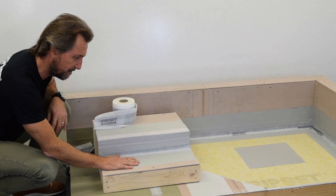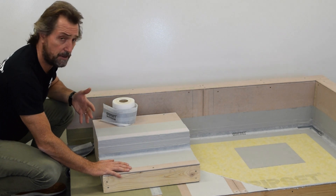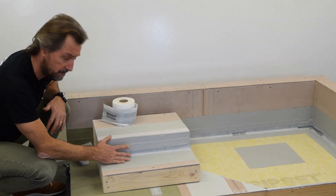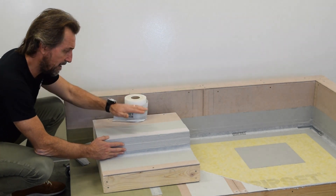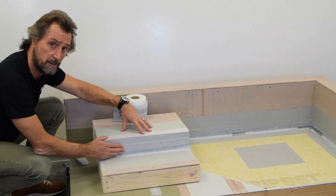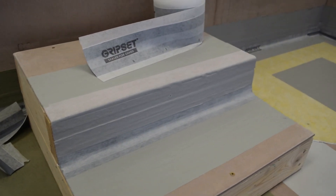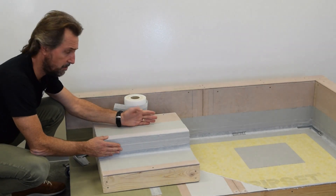In this example we've installed our P39, given the fact that it could be exposed to UV light for a while. The P39 would actually cover the whole section, but I've left it exposed just to demonstrate how the Elastoproof sits at this junction. Then we have the section that comes inside the room, before the doors and windows come in. We should be coming back about 150–200mm back into the room. There's a really good detail in the Australian Standard showing this — if you need a drawing or diagram, we'll pass it on.